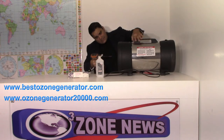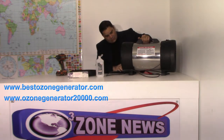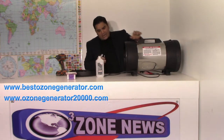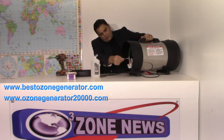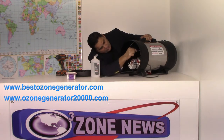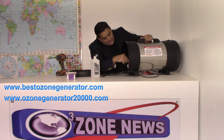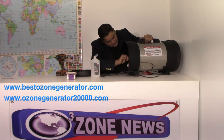We've got our cells inside here. We're going to take a Q-tip, and now that we've got this open and have access to the machine, we're going to soak the Q-tip really well in the ethyl alcohol. Then we're just going to reach inside and swab the plates themselves. You want to go over both plates on each transformer and get all of that black carbon buildup swabbed off the surface. It's just that simple — we've already done one fourth.